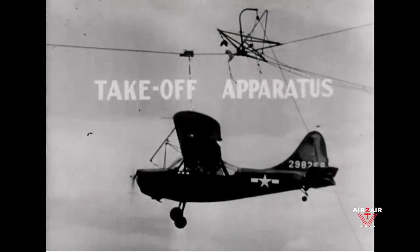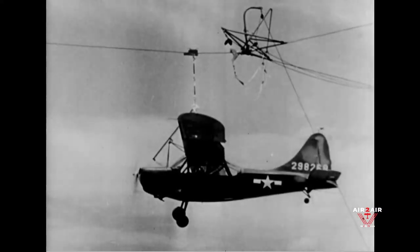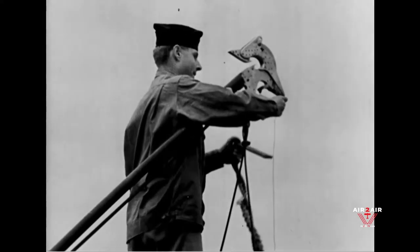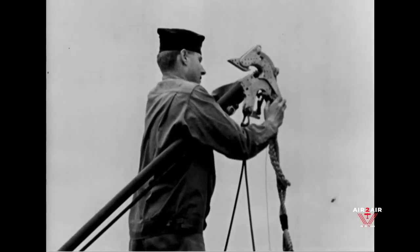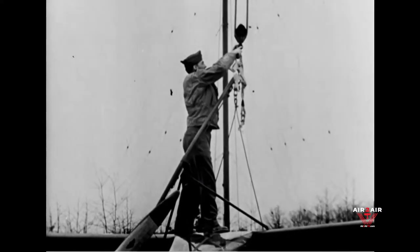The takeoff trolley rolls very smoothly on two wheels. Holding the plane to the takeoff trolley is the takeoff sling. Unlike the three-loop landing sling, the takeoff sling is a single 4-foot nylon rope. In hoisting the plane up, the bottom stirrup of the takeoff sling is locked into the plane hook. The derrick block is hooked into the center ring of the sling.